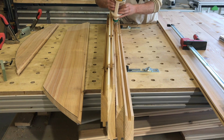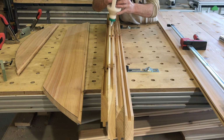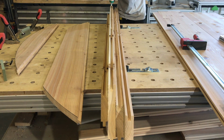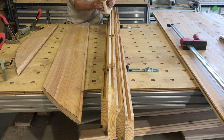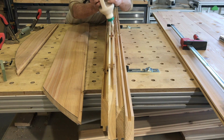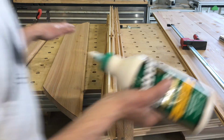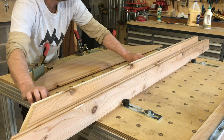And then what you've not seen yet, what I'm going to do next is I'm going to use a router and put a round edge on it because this is actually the top and it's going to be glued. So I actually found cutting the base, which was going to be inset, was easier to cut in a jumbo circle. And if you want to see that, it's quite fun to watch. I'll put a link in the description. Whereas because this is going to be in parts, because it's going to be impossible to lift this top off in one go.